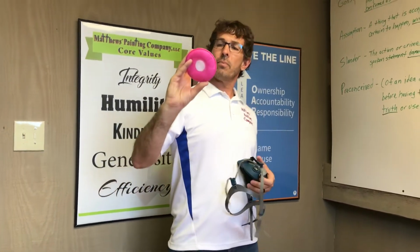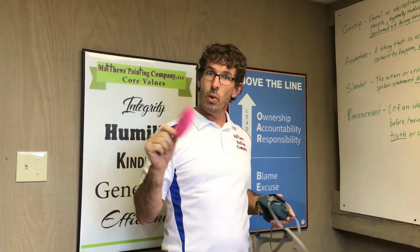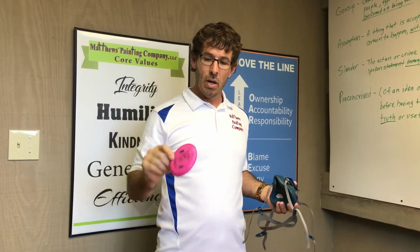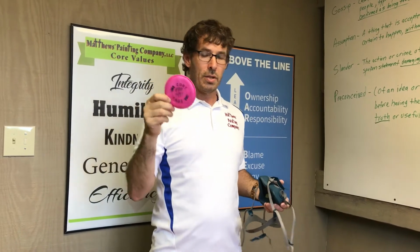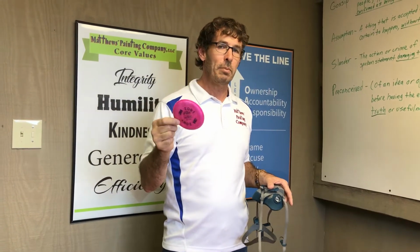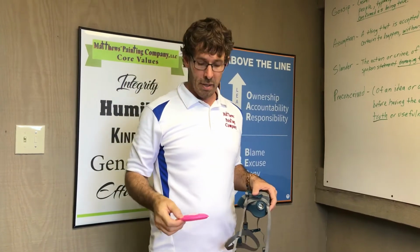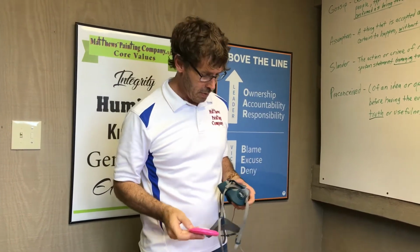And then these pink ones, if you remember, pink is kind of red. Red is for lead. So this is good for when you're scraping homes that contain lead, lead dust. Also pink particulate, particles. This does not protect you 100%. None of these protect you 100%. But this is not for organic vapors. This is not for your solvents or your oil-based stains or paints. That will still make you loopy if you wear these, and you will hurt yourself.